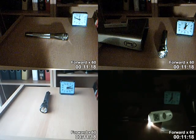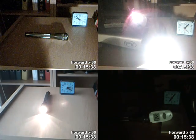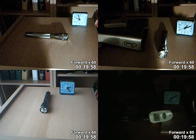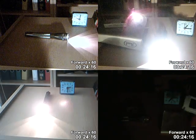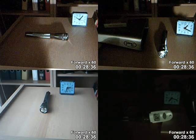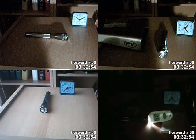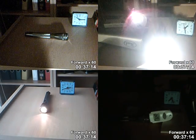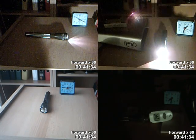The long and distinct on and off phases of the cycle are caused by complex events on the contact surfaces. First, when the lamp is off, some pressure is required to break the insulating layer of oxide and other debris that covers the contact surfaces. The lamp stays off until the reflector has contracted far enough so that the spring in the tail cap inflicts enough pressure on the contacts to break the oxide layer. When the layer breaks, the contact area melts and spreads. The contacts get welded together.